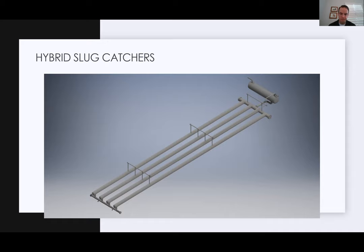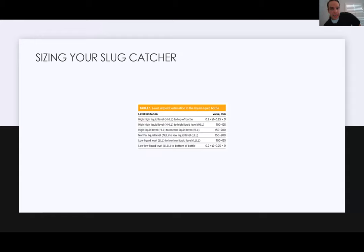All right, so sizing a slug catcher. As I mentioned earlier, they're meant to be pretty simple. They call vessels Coke cans. They're just sort of big empty vessels that try and get the liquid out of the way. And harps, they're meant to be simple. They're meant to be made with standard pipeline pieces of equipment, pipe and fittings. But really, when you get to the inside, you have a lot of things going on.